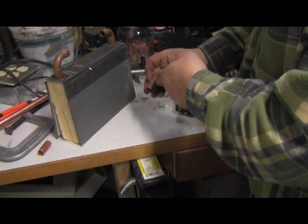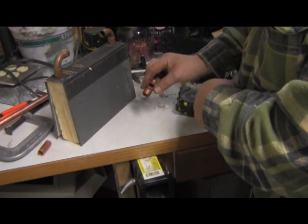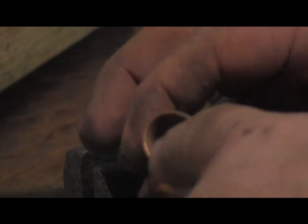It's really hard to drill on a round surface, but if you drill through the hole that way it'll work out fine. It took me a while to drill that hole — I don't want to push too hard because I couldn't clamp it very tight, and the last thing you want to do is turn this thing oval and then you'll never get your pipe in. I got a small hole drilled; now I can flip it over, stick it back in the vise, and get a larger one that the wire will fit through easily. That'll fit down through there and up the line, and then I can silicone that to keep it from messing up later.